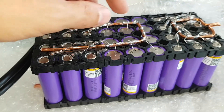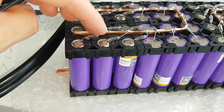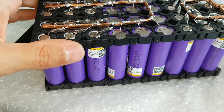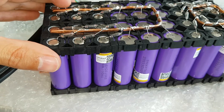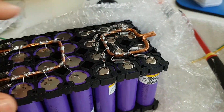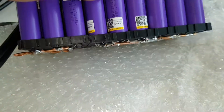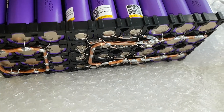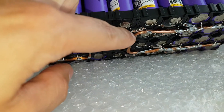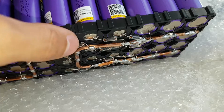There you have it — the cheap spot welder using a motorcycle battery. I'm running a copper bus bar here — a 'kabel' as we say in Swedish, I think 'strand' in English — that I just bent and soldered the fuses to. This is 5-amp; the first one I did might be 4-amp, but this one is 5-amp. We'll see if they hold. Same style fuses on the plus side, no fuses on the negative.